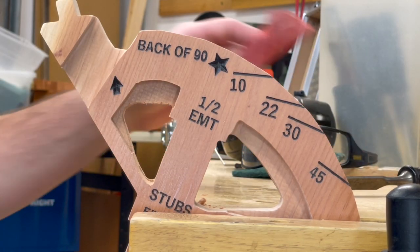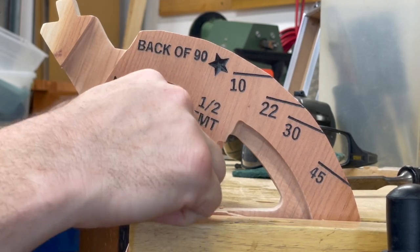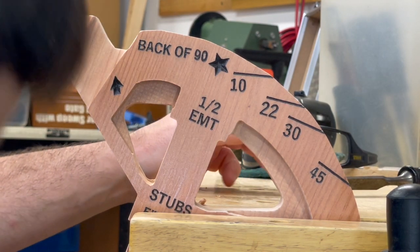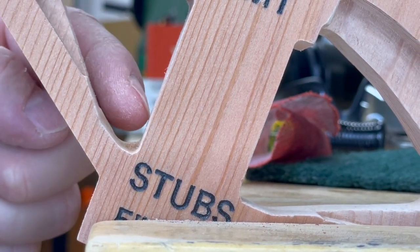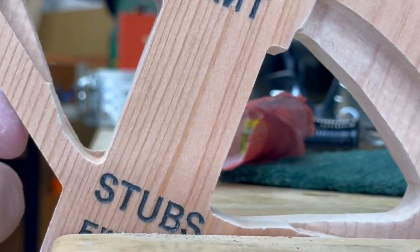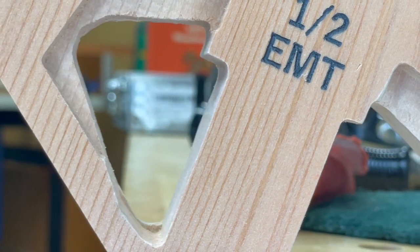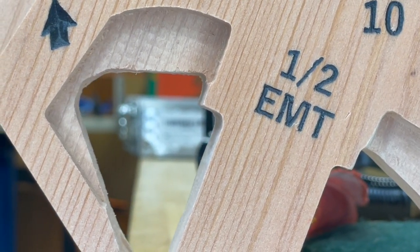Lesson learned number one: it threw smoke — I was actually burning the wood instead of sanding it. Lesson two: while it was genuinely faster to remove material, I had to be extremely careful not to take too much. I want to retain as much of the original shape as possible. In the bottom corner I had to stop to avoid messing with the side edge, so I'll finish that with the chisel and sandpaper. Because of the angle, I didn't want to round out the inside too much. Up in the top corner though, it worked out really well — I got very close, and the sandpaper should take care of the small remaining lip.